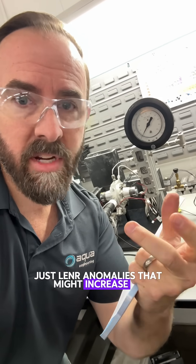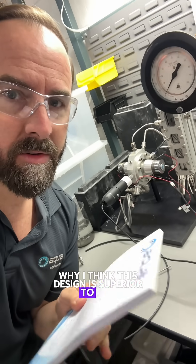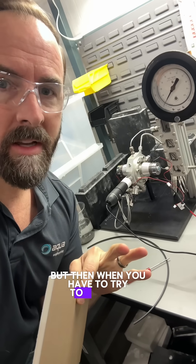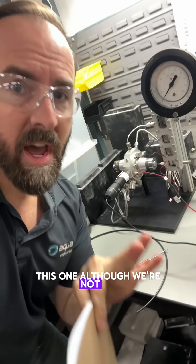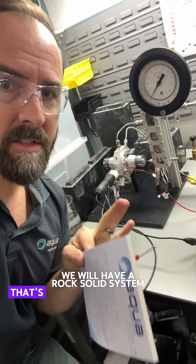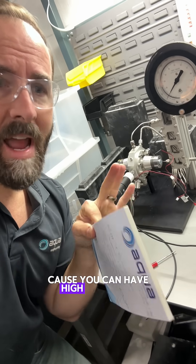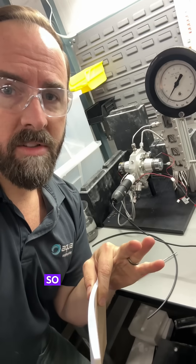Just LENR anomalies that might increase as a result. It's a good time to highlight once again why I think this design is superior to a glass flask design for doing sonoluminescence. It might be easier to achieve sonoluminescence with a glass flask, but when you have to try to harness high pressure and temperature, you end up with a really delicate system. This one, although we're not to sonoluminescence yet, when we get there we will have a rock solid system that's essentially commercialized — can be sold as a kit or you can make it yourself from the GitHub instructions. At that point you can do serious research with it, because you can have high pressures, high temperatures, and do what you want with that in software.